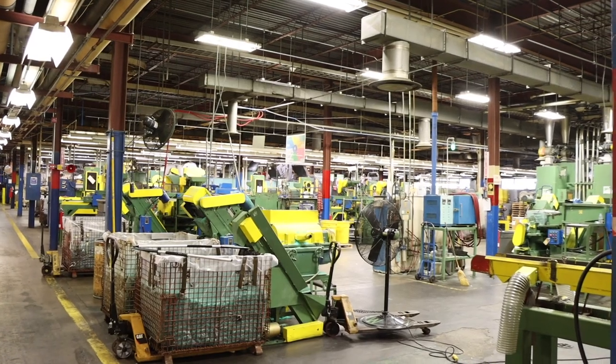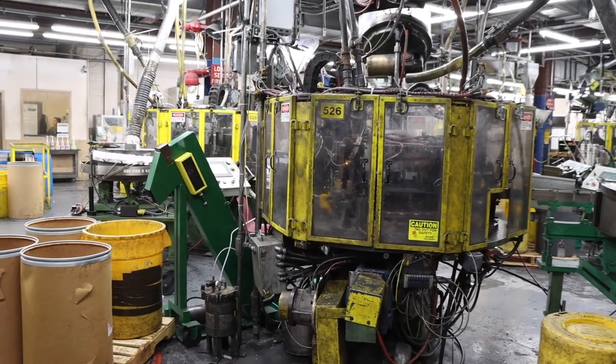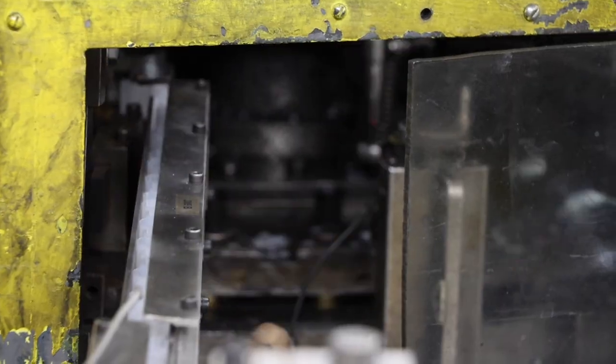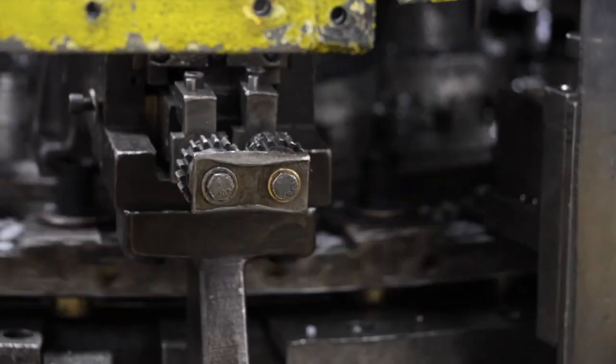Once those are manufactured, they're washed, tested, and inspected to make sure there are no inclusions. Then they go into the AH&P — the add head and prime — where they take the primer manufactured earlier, the cap (whether low base or high base depending on what you're doing), and the body that corresponds with what you're trying to build. If it's a three-piece, you have the body, the cap, the primer, and a base wad. If it's a standard load like a gun club or STS, you just have one body, one cap, and one primer — all seated in the AH&P.